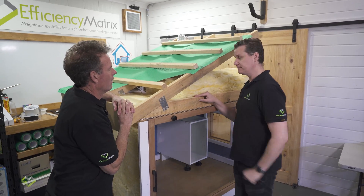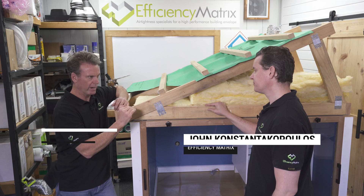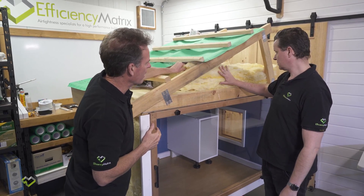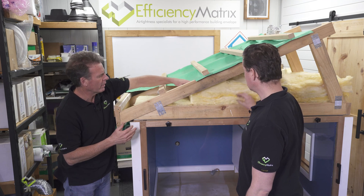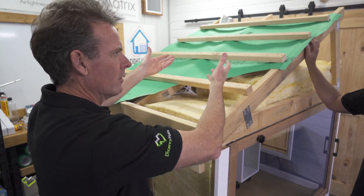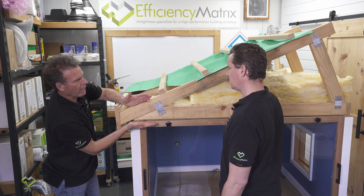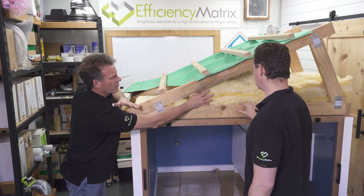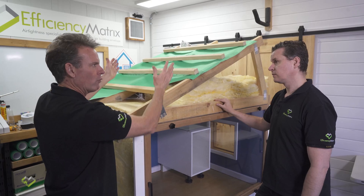What's the problem here? There is insulation here, but in the last 10 or more years we've been targeting very high efficient housing performance rates — six star, seven star, eight star. High ceiling bats R5 and R6 have been introduced, so they're going to be 240 to 270 millimetres high. The problem is you can't install this very high ceiling bat all the way across the ceiling because it will stifle airflow into the roof cavity — it'll be hard up against the underside of the roof. With a standard truss roof we only have about 100 millimetres above the top plate around the external wall to accommodate insulation, so a 200 to 300 millimetre bat won't fit. There's a standard that requires you to maintain a 20 millimetre air space above the insulation and below the roof so there's natural airflow in your roof cavity.